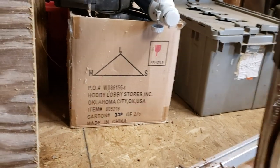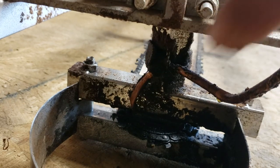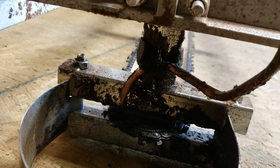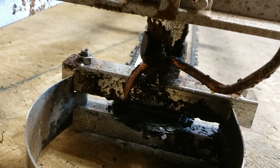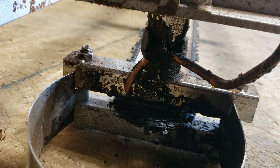I use a piece of copper tubing and take it down with a Velcro strap, and it's just aimed right at the tip of the bar. It's annealed copper, so it's soft and flexible. Which means if it vibrates around and hits the teeth, it doesn't do anything — it's so soft that the teeth just cut it. It's a little more than wood, but it's soft metal so it doesn't damage the teeth.